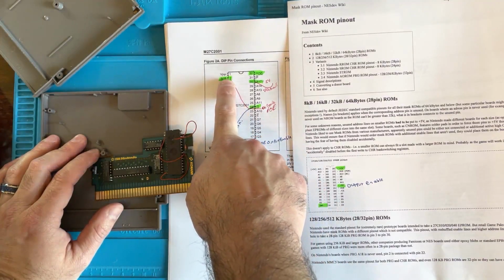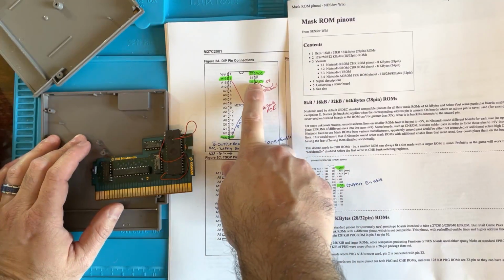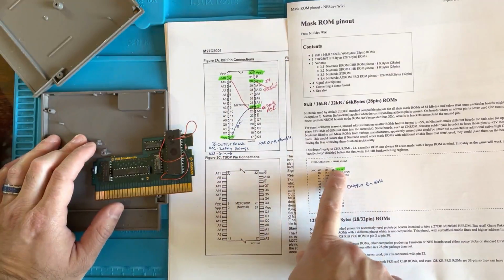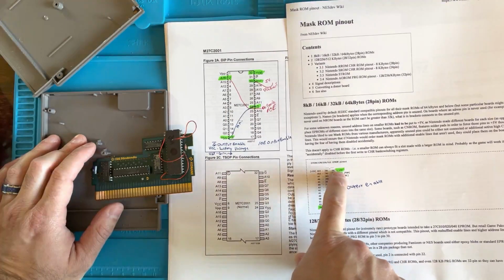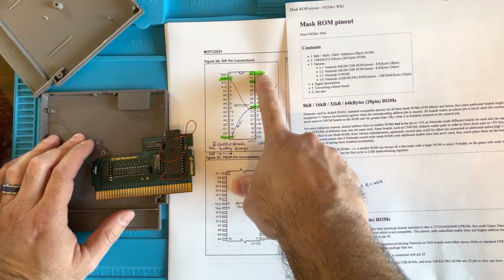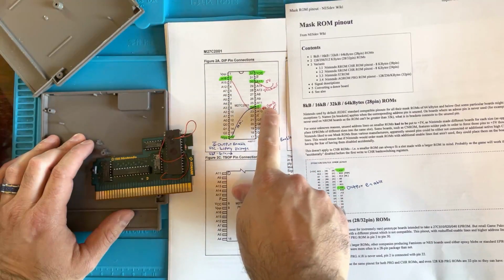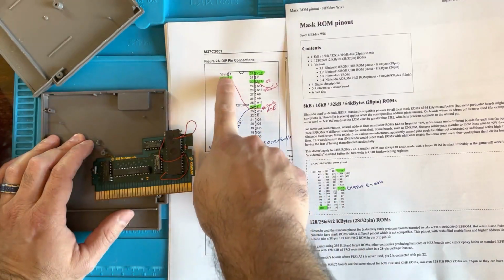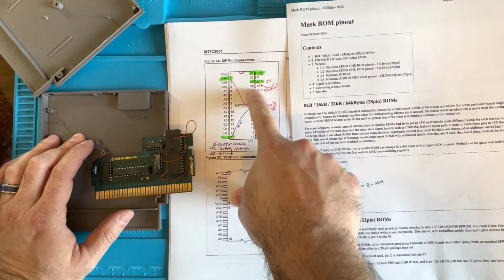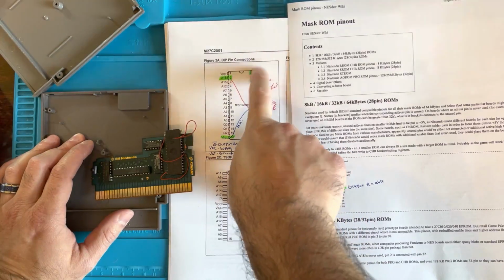And then you have this wire here from A16 going to the board here, which is the output enable on the board itself. So now we have this wire that is on pin number 30, is A17, which is 5 volts on the normal Nintendo chip. And this is just hanging, it's disconnected. So I'm thinking that it's going to go to this VCC, which is supply voltage. But we also have voltage here. So we have 5 volts here going to the, because this is what it says on this schematic here. So we have 5 volts on A16 going to the board on the output enable. And we also have this 5 volt line just hanging. So what I'm thinking is I'm going to connect this 5 volt line back to this VCC, because that's where I think it came from.